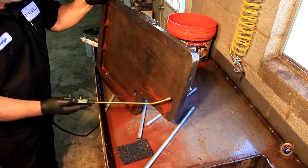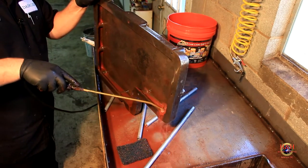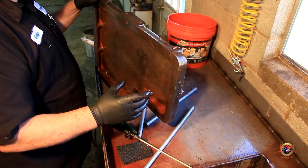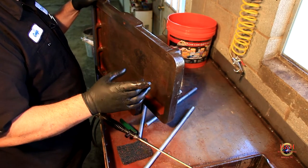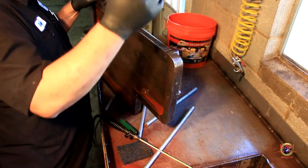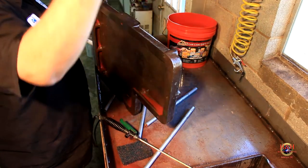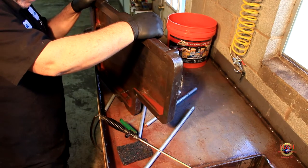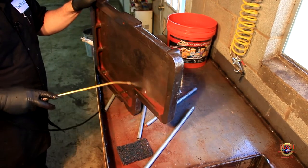But the little wand on the rinse sprayer, what I'm probably gonna do, I seen my wife watering flowers and they make these little wands. It doesn't put out any pressure, but it puts out a pretty good volume. You can buy those little replacement ones, just green plastic with a bunch of holes like a shower nozzle. I think I'm just gonna do that. Probably put a line from the hot water heater that's gonna be in this corner and just bring it over and drop a little line in here. I might even get Froggy and put a foot paddle on it to actuate it. So I don't know, we'll see.